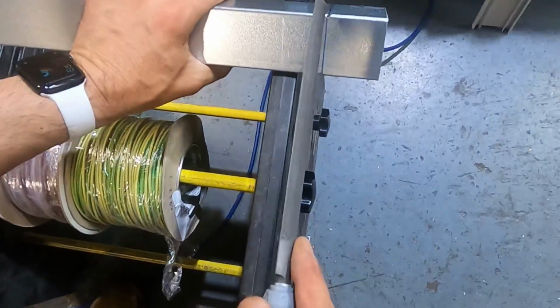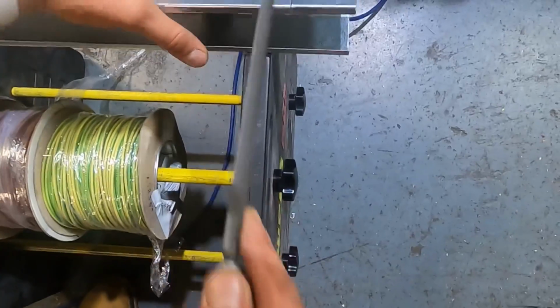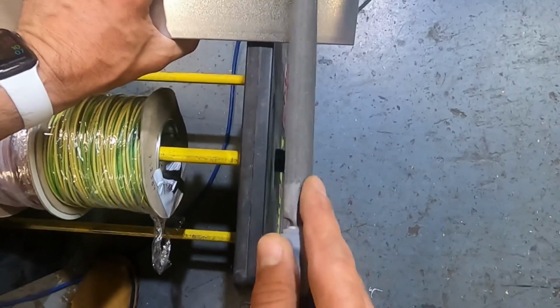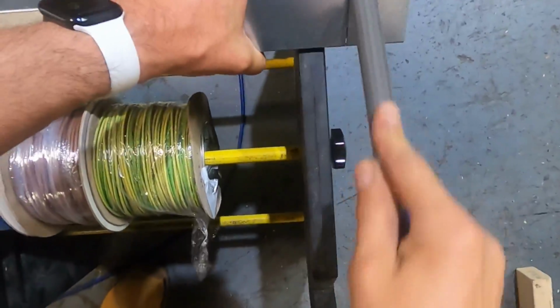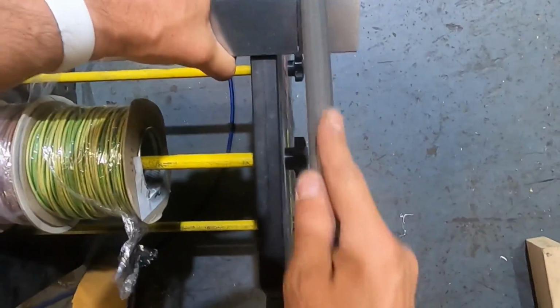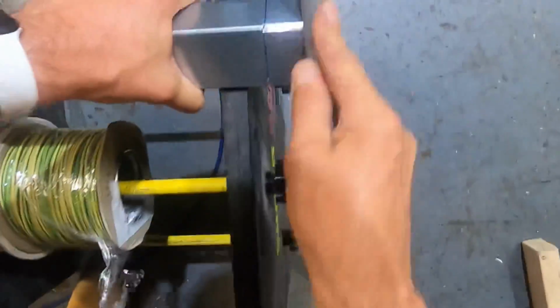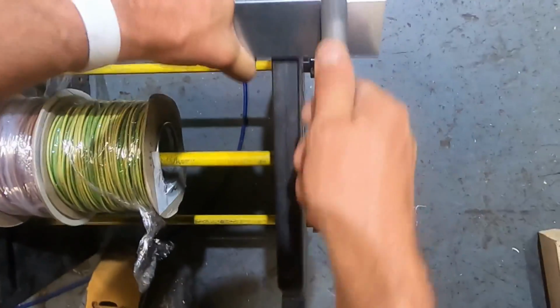And whenever you want to bend a bit of trunking, what I want to do is mark it. I want to cut there because that'll bend down, that'll bend along there. Just file it. File it on that corner, and eventually it'll go through so you can bend it nice and neat.